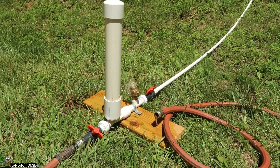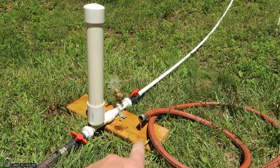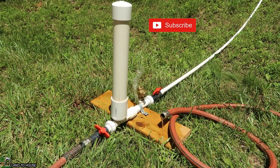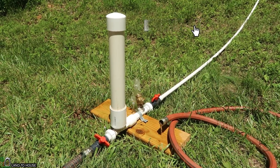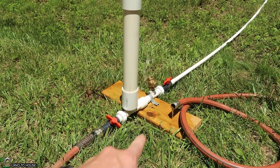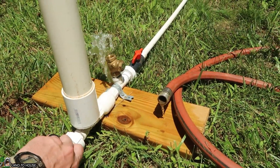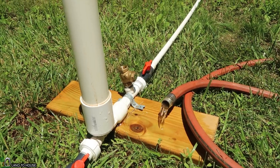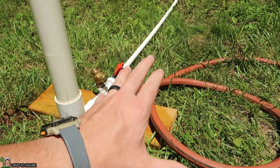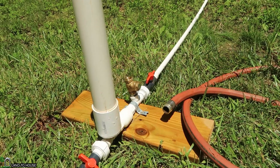Here's another very cool idea I've never thought about: you can actually nozzle down the delivery so close to being off that you can have water pouring through here and the back pressure is still maintained in the pump. That is probably an even easier way to get this done. The pump is pushing water through the hose and it's coming out pretty good right at the pump end. As soon as I open up this valve it should gush out a little bit and the whole thing will stop. So there are definitely ways of getting this thing full, and once you stop the pipe is totally full and can be hauled up the hill.